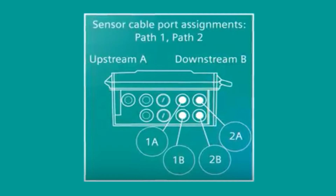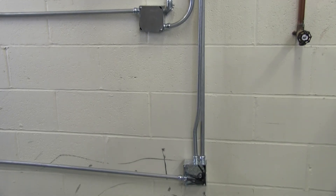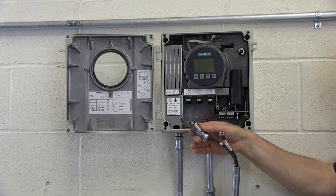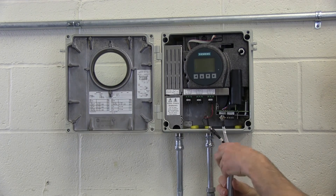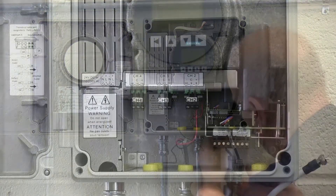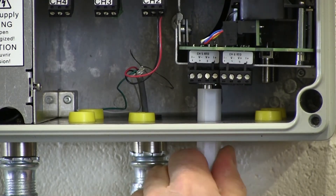These connections are illustrated on the meter's label. Install your rigid conduit run between the sensor location and the transmitter with a pull box below the transmitter — do not attach the pull box to the wall yet. All sensor cables from a single transmitter can be run in a common conduit from the pull box to the sensor location; however, separate conduits are necessary between the transmitter and the pull box. With the cables pulled through the conduit, slide an NPT compression fitting and an adapter onto each cable. Remove the F connector tool from inside the transmitter, slide it over the downstream cable while pushing down on the conduit for clearance. Use the F connector tool to fasten the cable to the F connector of the DSL, then repeat the process for the upstream cable connection.